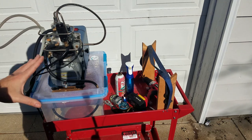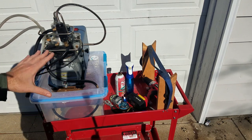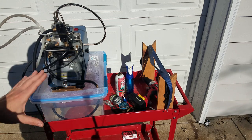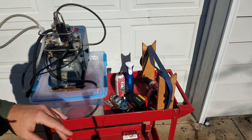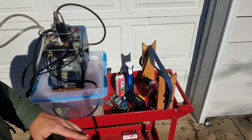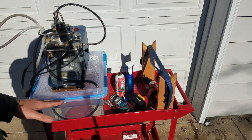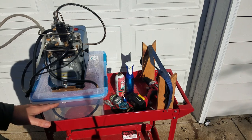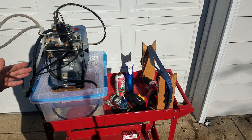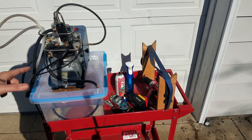The pump did not overheat — someone will probably comment that I let it overheat, but that's not the case. It was simply wear from filling a high-volume high-pressure tank. When just filling a single air gun as I normally do, this compressor will never overheat. Just follow the manual, allow it to cool down between fills, and it'll be fine. A bottle or large tank is a very different load compared to a single air gun.